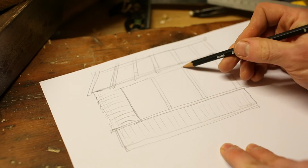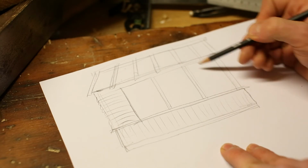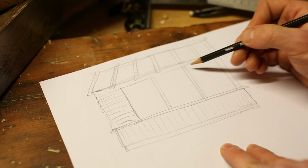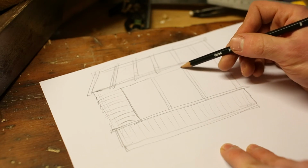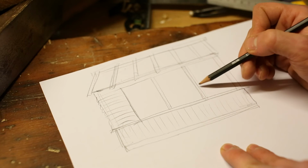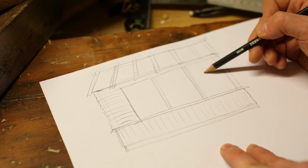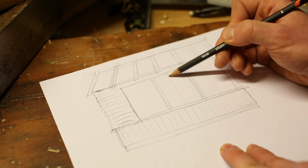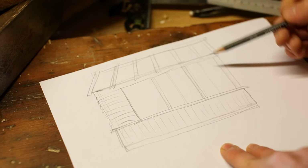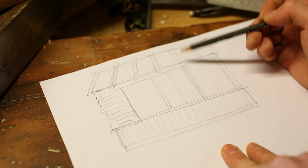So what I'll be doing is I'll be fitting the frame, kind of face fitting it onto the 2x4. And once we've got that, then I'll use a capping piece, which will be probably a 2x1, which will sit over the top of that and clamp the frames in place. And actually the first 2 windows are divided in 2 and they slide open and shut. That'll mean I won't have to have an opening vent or anything on the roof.